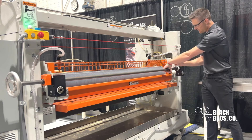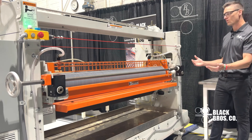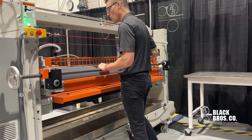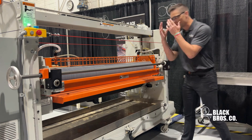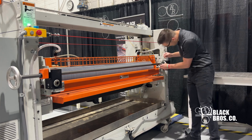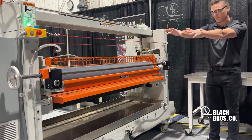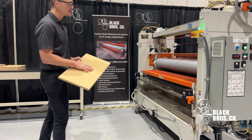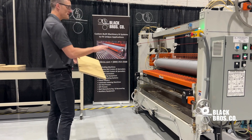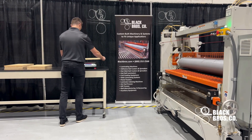There's a pin here — you just pull it out, simple as that. Now I can adjust these rolls accordingly. I gave it a good quarter turn or two quarter turns. From a visual standpoint it looks okay. I'll move back, put the pin back in place, and use the hand wheel on one side to move everything back in unison. I'm back on the outfeed side again. I've looked at it and made my adjustments — let's tear this next board.